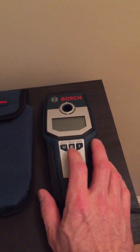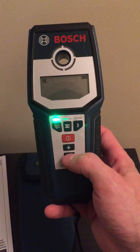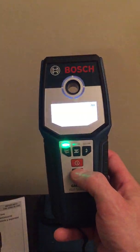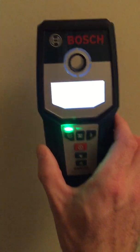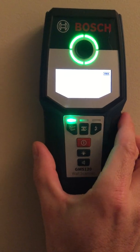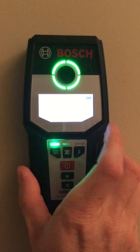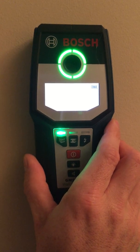I'm going to start the demonstration. First is my standard one-inch thick 1950s drywall. I'll turn her on and she'll fire up. I'm going to turn the backlight on because it generally works better at angles with the video. I'll also turn the sound on for a little bit — it can get a little irritating. I'm going to place the stud finder right in between where I know two studs are. When you're in wood mode, by the way, it will detect metal and electric but it'll just give you symbols for it — the crosshairs only apply for wood.